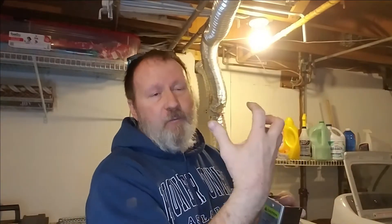I was going to make a video of replacing that and rewiring my zone valves, but things kind of went wrong. I found out my zone valves are the pre-1985 or 1986 ones — normally you have the power head that sets over this valve and the gears and motor spin this to open the valve. But the old pre-1985 design was all one solid unit; the power head didn't come off separate. I didn't realize my zone valves were so old — probably original to the house.